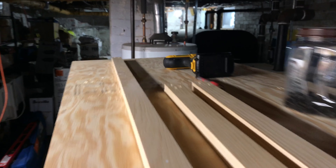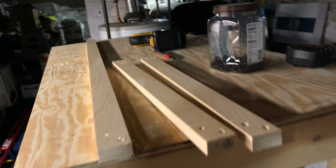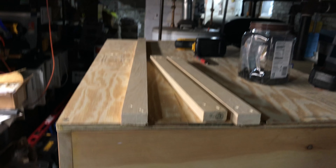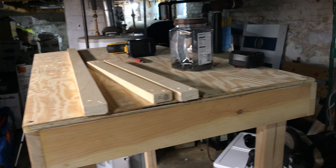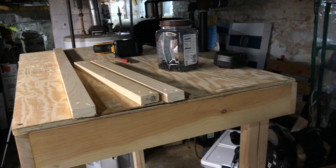Time to finish up this bench work. What I want to do next is add a shelf down below — I have this piece here, it just needs to be cut to the appropriate length. The first step is to put cross braces and a back piece on. I had these kind of already pre-cut, though they weren't quite the right dimensions, so I went and cut them to the appropriate size and pre-drilled them. I'll attach these, then take a measurement and get the final cut on the shelf board.